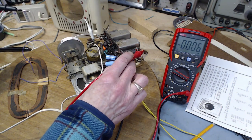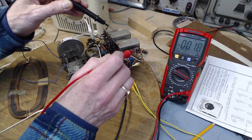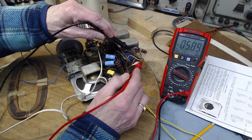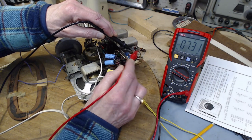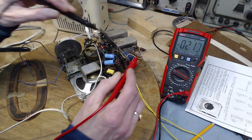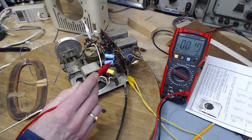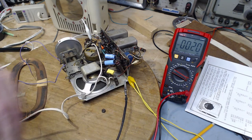I think these are the two dropping resistors. I am now going to measure the drop on these resistors. 60 volt scale. This big one. Okay, so it's not quite 6 volts, and this one. So together there's 16. Where's 35 volts dropping? Is it this guy? This is right in the filter. This big one here. And there's another higher wattage one here.